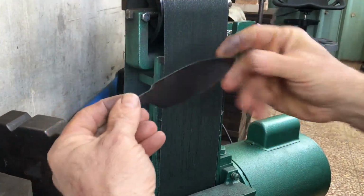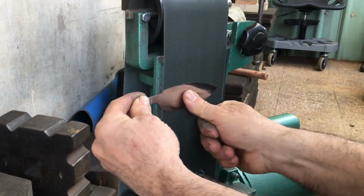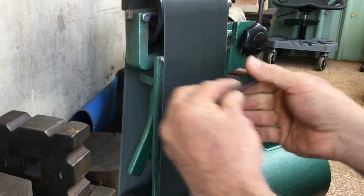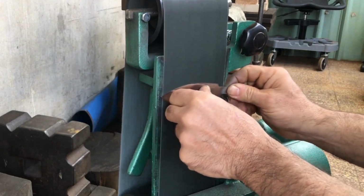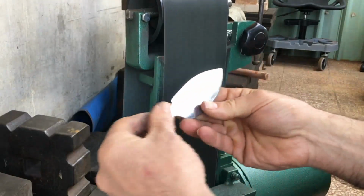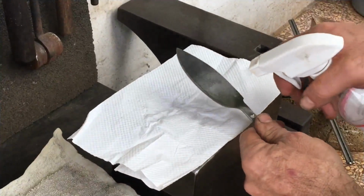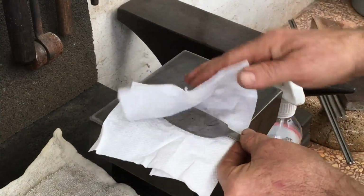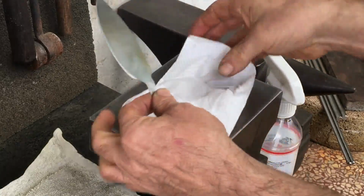I've been helping friends and family to fix and sharpen their knives. This blank here, I shaped it from another knife, just an old IKEA knife. It's more than likely that this is a 400 series stainless steel, which is high chromium and has a decent amount of carbon and is magnetic. So I've been experimenting with creating faux pattern welded looks, and so I want to try something today on this blade and see what results.